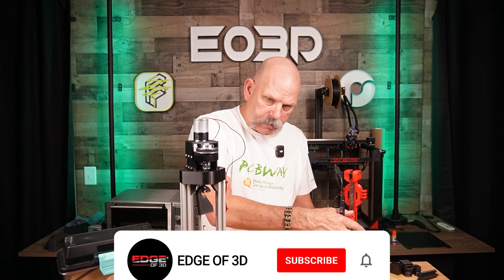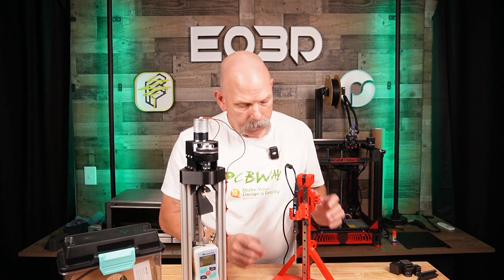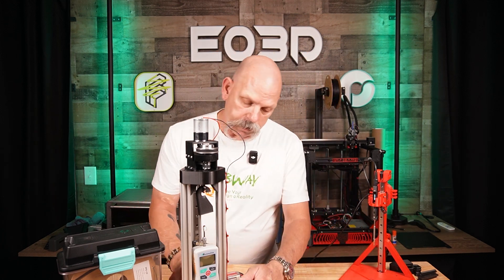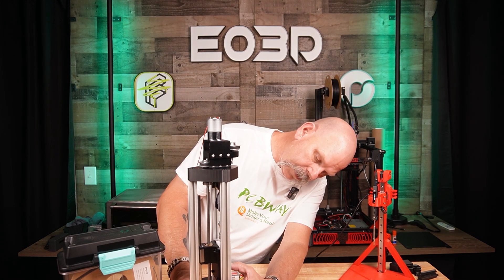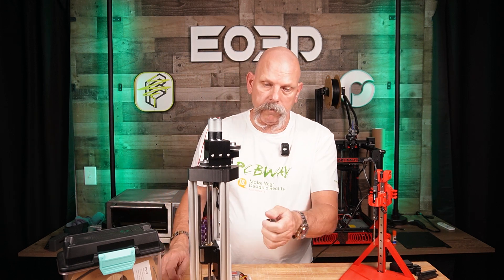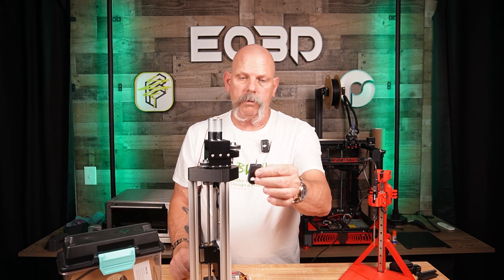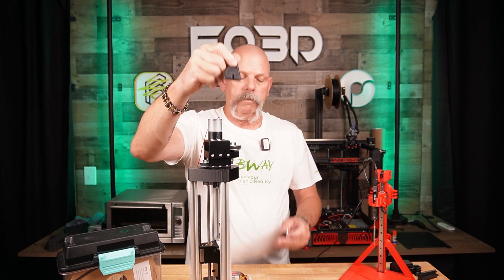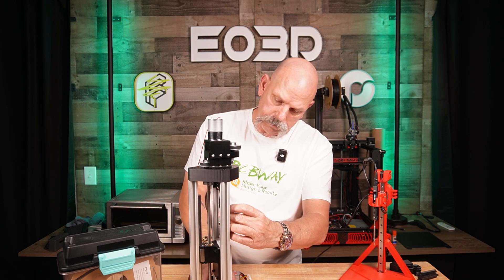This is setting at 370. Let's put this on standby so I don't burn myself and get this set up. We want peak, and let's go ahead and do it in kilograms. That's cooled fairly well — I can put my finger on it without burning myself. That just threads in there enough to go all the way through the heat set so it's fully set in. And then this part just has a slot that sits in there. We'll put that on like this.